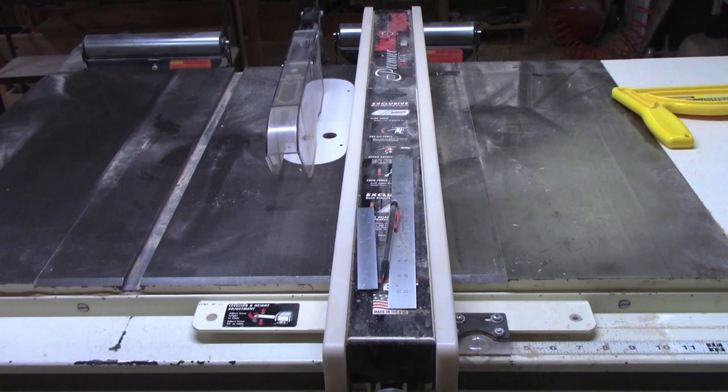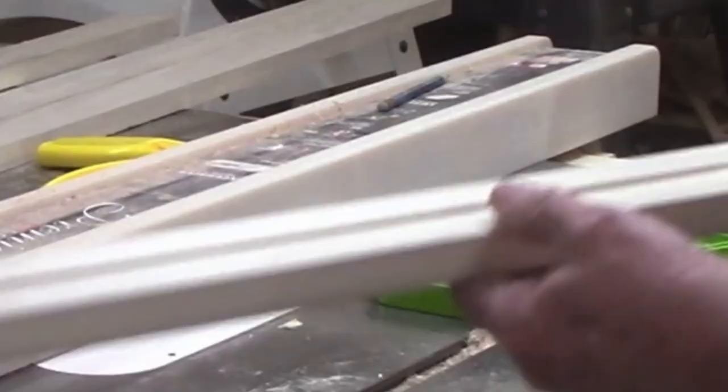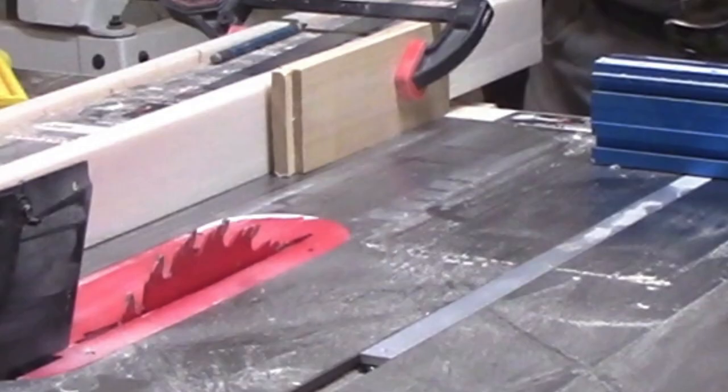Those are some of the basic things you need to know and follow to operate a table saw safely. It is a versatile tool that can rip stock to width or cut it to length. As I showed you, it is possible to cut any number of parts to the exact same length using the miter gauge and stop block clamped to the rip fence. You can use a table saw along with a dado blade to make dados, rabbets, and grooves. I would love to read your comments on this video and I respond to every one. Make sure you are subscribed and hit the notification bell so you do not miss any future videos. If you frequently need thinner stock than what is available from your suppliers, you should consider making your own by resawing thick stock into thinner stock.